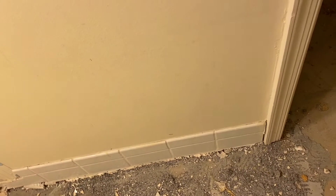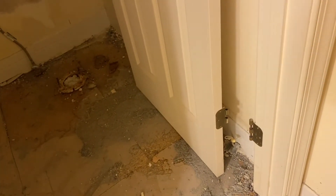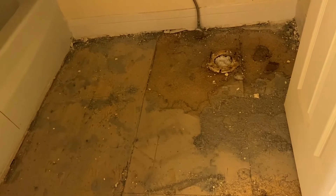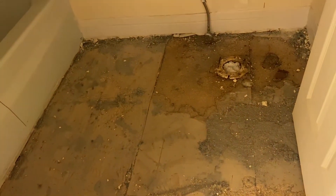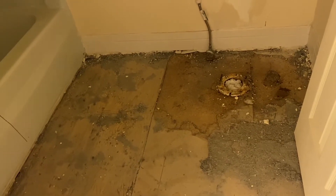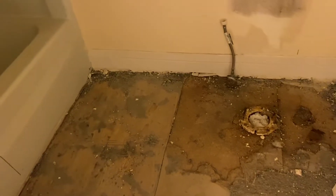What I'm trying to say here is that with tile work, the key is the subfloor — the surface underneath the tile is what's going to give you a long-lasting job, assuming it's structurally sound and doesn't have any bounce in it. By taking care of all those things, you'll end up with a nice tile job at the end of the day.